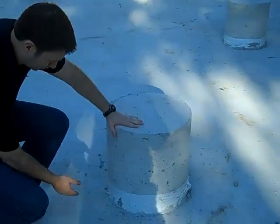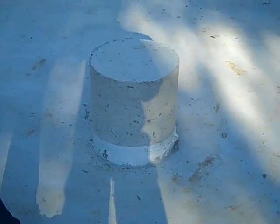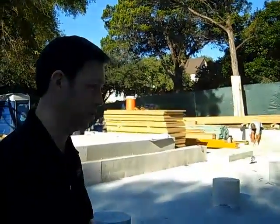What we're doing with this house — and this is really the point of the video — is a conditioned crawl space. Where I'm standing now in this space, this concrete slab you see here is basically just a flatwork slab. We use a 10-mil poly vapor barrier, run that vapor barrier up the walls, and you can see it's taped and sealed real well to our piers. This slab is just 4 inches thick so that we're creating in effect a short basement for this house. We'll come back on the next video — we're going to frame this floor over the next two days, and then spray foam the perimeter of the slab to turn this into a short basement. This is what we call a conditioned crawl space — it's really the absolute best practice you can build for this hot, humid climate.